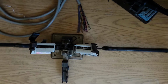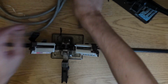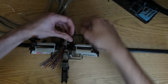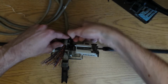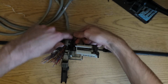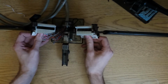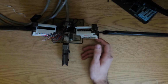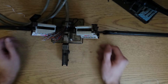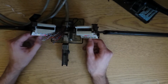And there's a spring clamp here. You undo, place the cable into it, reclamp it, and it holds it there while you're working with the wires. So from there, I'm going to flip these legends around to the male side for putting on a male connector, and it gives you the 25 pair color code here.